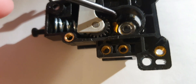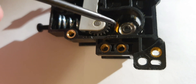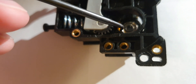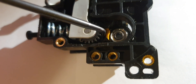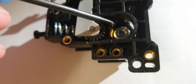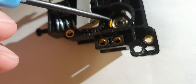The filament is getting pushed from the top here and down. But I have a suspicion that if there is the slightest curve of the filament, it hits the edge on the inside or the outside. Then you get your first sort of stumble or stop, because it cannot push it through. So it tries to put the filament back, but because on the first push down it cannot get through the hole, it creates a bend on top. It tries to pull it back but cannot pull it out because there is already a tiny bend.